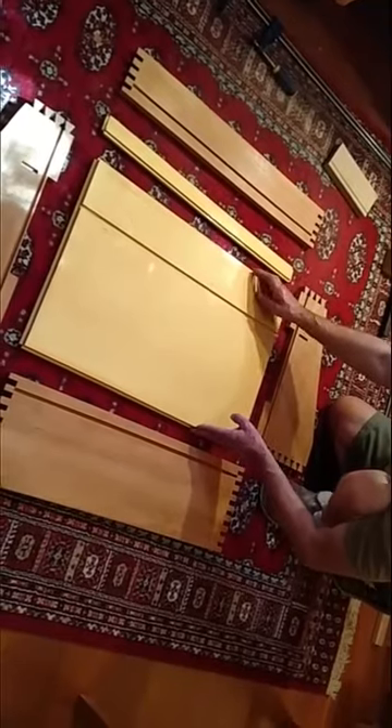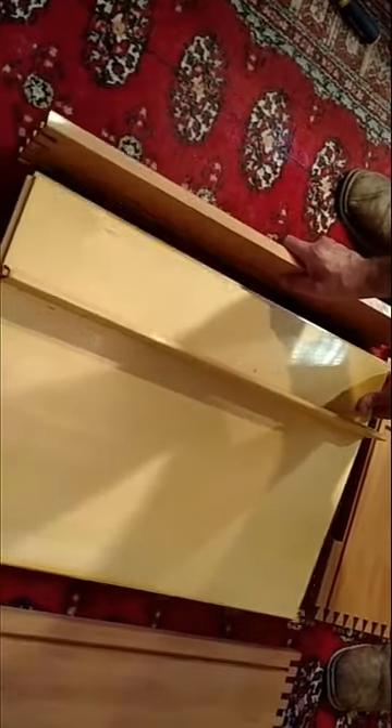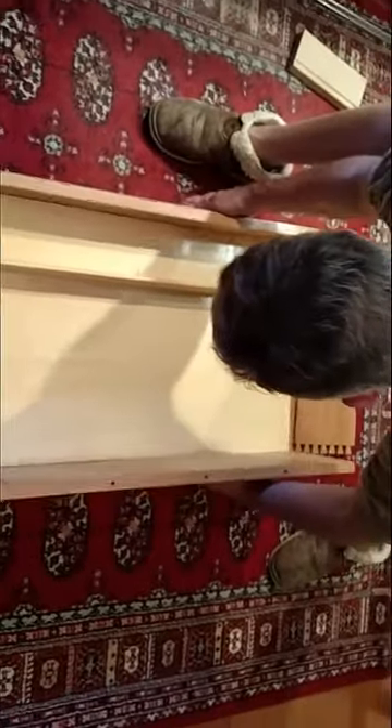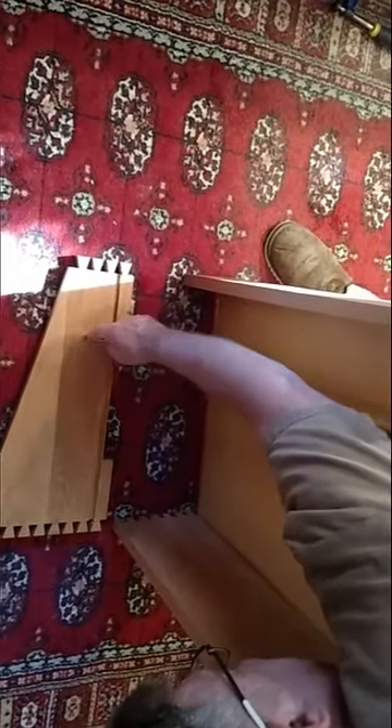You might need a helper for this. The easiest way I do it is to start by putting the divider here. We want to assemble the sides — basically lift this up a little bit, put the groove into there, then do the same on the other side, lining up and getting the groove in. This is the part you might want a helper for — keep it square and tip it up. These are dovetails: these are the tails, and these are the pins. We want to align the pins directly over the tails on both sides, and also align this little divider's mortise and tenon. It takes a little bit of adjustment.